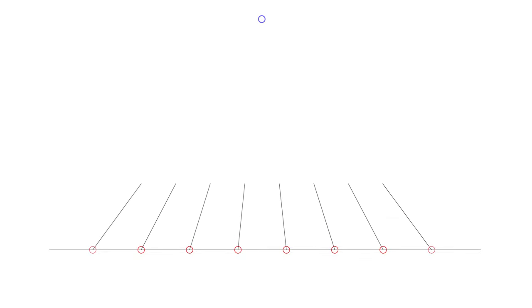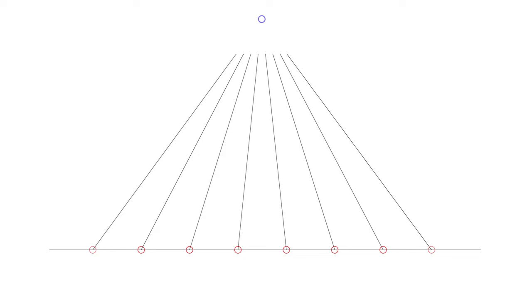Now simply to make the division board, connect each one of these points on your baseline with the fixed point above the baseline. Thus with all these lines drawn, the division board is made. Now to use the division board you start with a batten. There are two marks on this batten representing the distance that you want to divide evenly. In this case the two marks represent the shear line and the lap line for the garboard for a given mold.